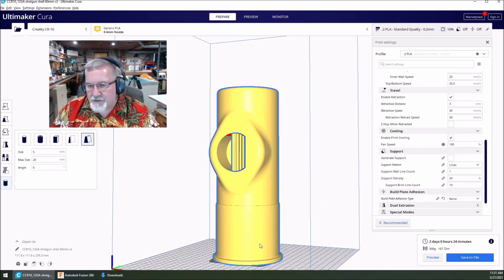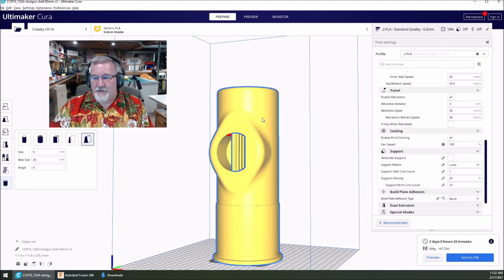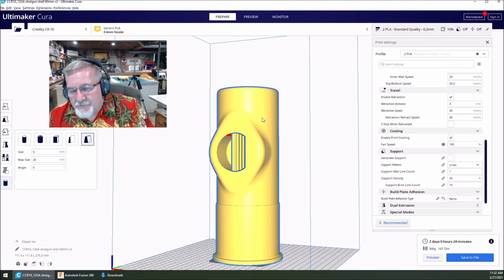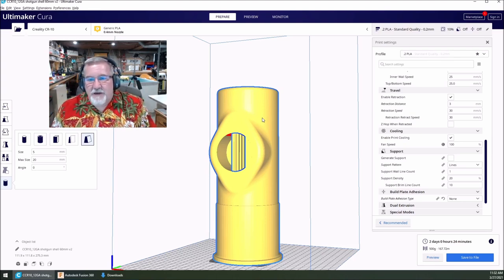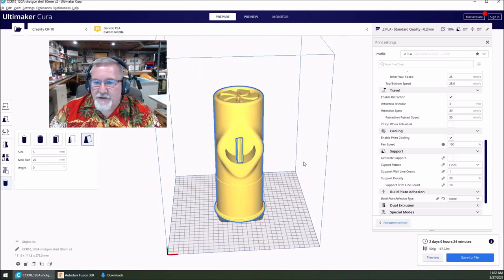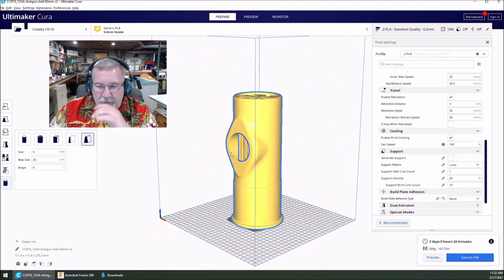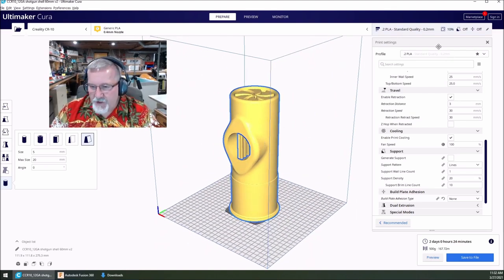Let's do a center rectangle right here — make this 100 millimeters by 10 millimeters. Now go back and trim and delete the features we don't need. Let's go trim — now you see what you've got. Put some fillets in — just go with the default fillet numbers. Finish the sketch. Extrude it and make it about 20 millimeters wide. Hit okay, rotate around — see what we got. We've got a stand.